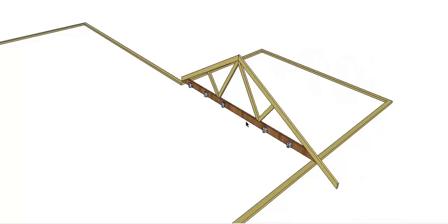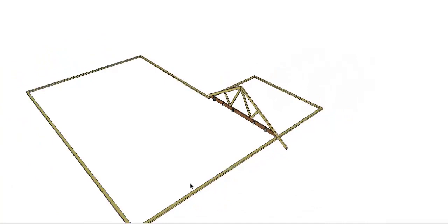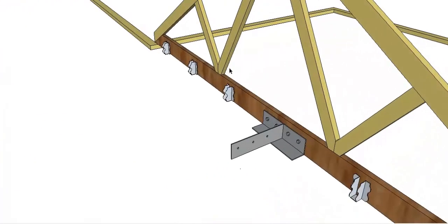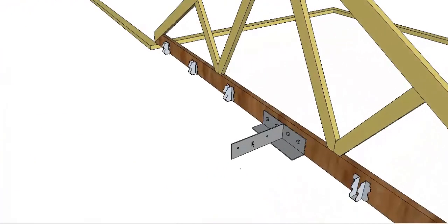Now you can see there's a gap here. The way truss manufacturers work is every roof they build has a certain setback — no matter how big the roof is, there will be a set distance from the end of the building that their first truss is going to run across. It could be 1800, could be 2.4, but they'll generally all be the same. Because that is generally a girder truss as well, the actual fixing point on that truss needs to be beefed up a bit, so they can use a high load bracket — there's a heap of different brackets on the market now.